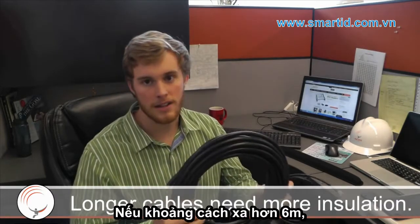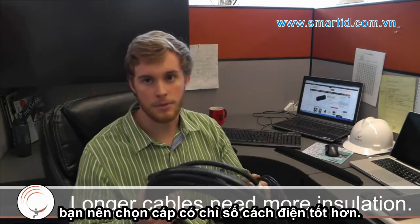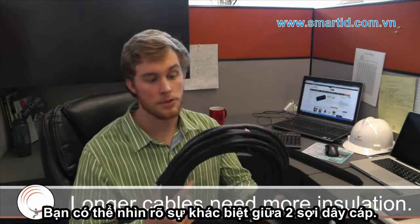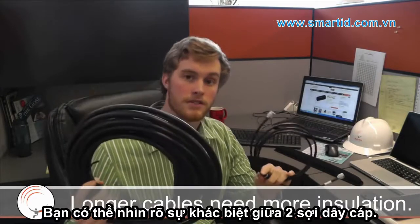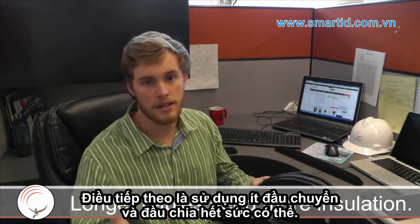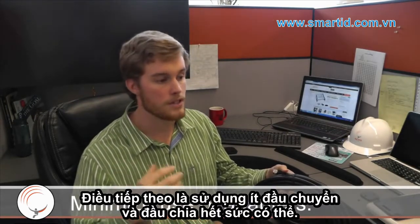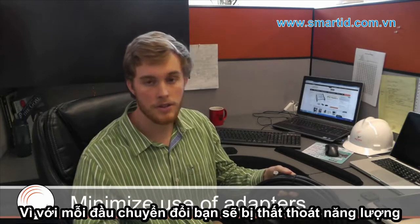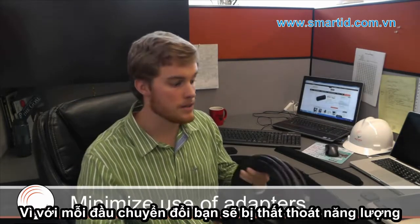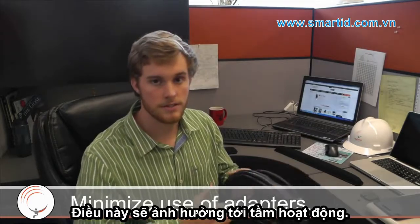Now, anything beyond that distance, you're going to need to start thinking about insulating your antenna cable a little bit better. And up to a point where you could have this much of a difference in the type of antenna cable that you're using. So the other tip about antenna cables is to use as few adapters or ports as you can, because every time you add one of those on, that's going to add loss in between your reader and your antenna, which will decrease your read ranges.